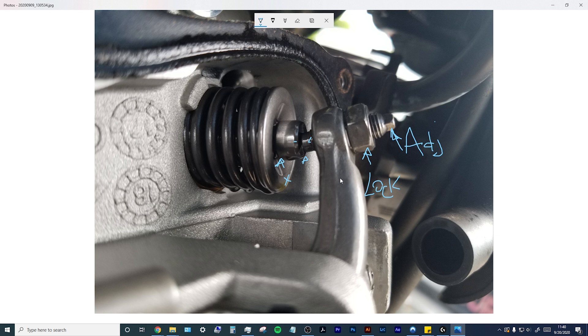Again: your 0.004 should fit. Your 0.005 should fit, but it should be really tight — it should still be able to fit. And then your 0.006 should not be able to fit at all. That's how you know it's properly set. So again: 0.004 should fit, 0.005 should fit tight, and 0.006 will not be able to fit at all. If the 0.006 fits, then you need to tighten it even more. This is your lock nut — that's what holds everything tight. This is your adjusting bolt. You loosen your lock nut, adjust the top bolt as needed, then lock it back down with your lock nut after you get your spacing correct.